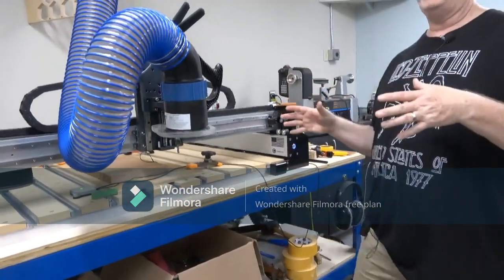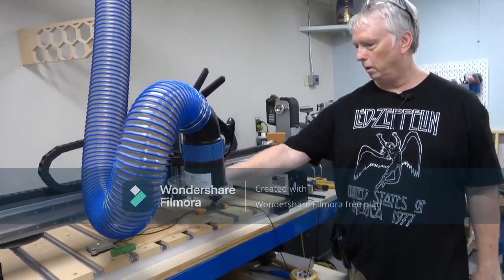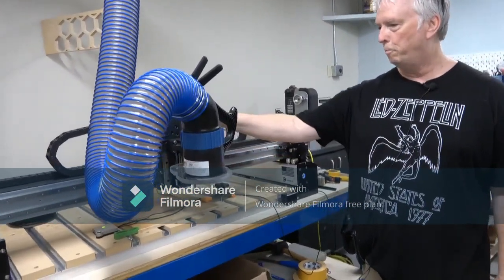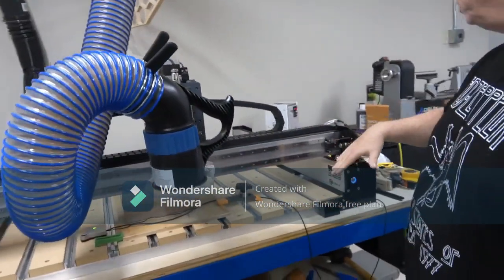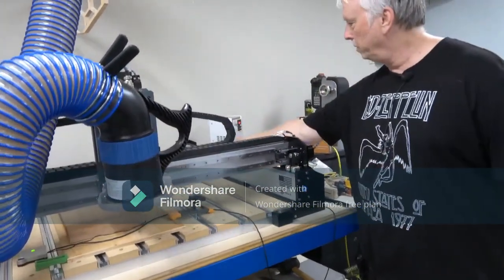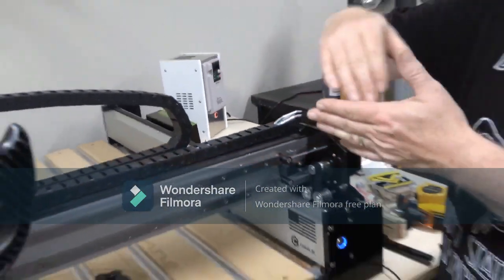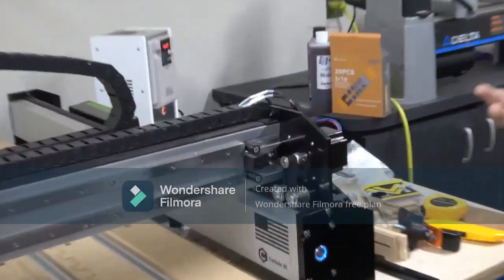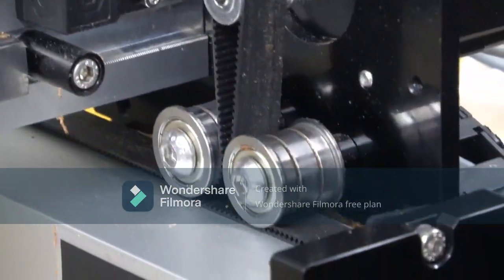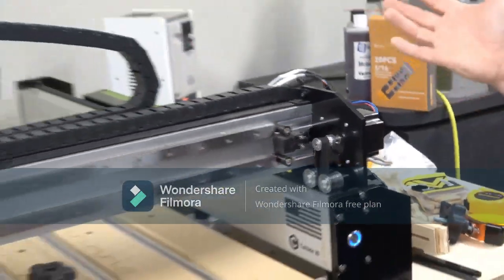This machine is fantastic, except for one thing. You've got a rack and pinion system here. You got a ball screw system here. This thing is beefy, hardy. Aluminum extrusion, full table rails. The one thing though is back here, this is a belt tensioning right through here. And this thing can stretch and it will throw an axis off and your whole cut will just come off and keep going way off and just ruin a piece. And it has happened frequently. Well, in my opinion, too frequently. Although it has not happened in about 4 weeks. So this thing has been perfect.